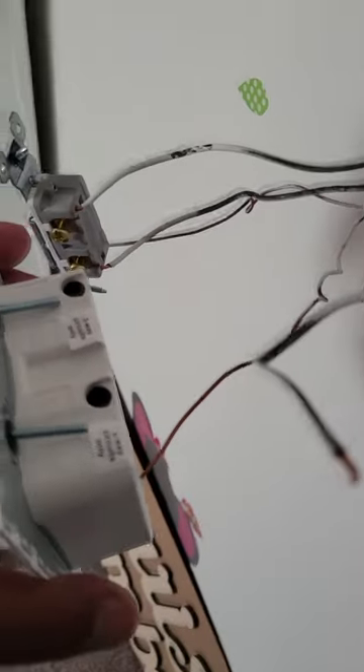At the top you've got your L1 and L2 — that's my non-common wire, which is this red one here, and it goes in the top. For the fan light, you just have two black wires. One goes on the top and the other is the common wire that goes on the bottom. The fan switch is fairly easy — not that complicated. You put one on the top and one on the bottom.